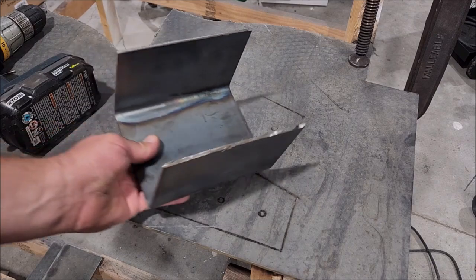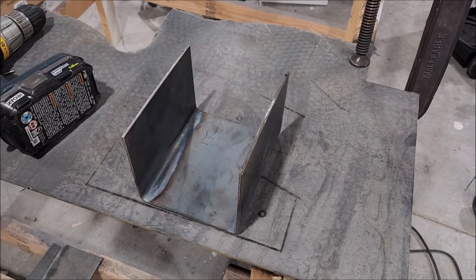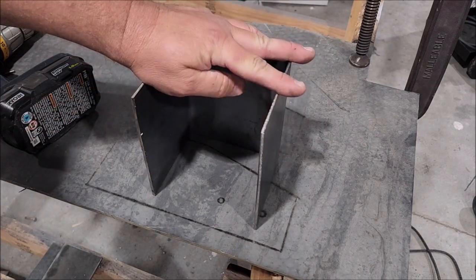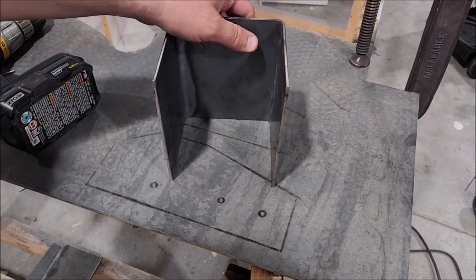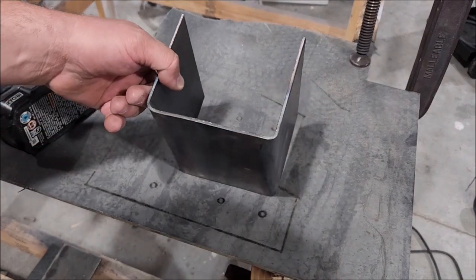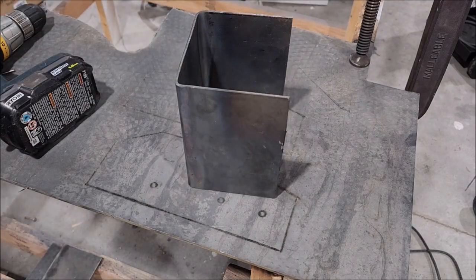It has cooled to the touch and I'm happy — I bent it. Welding it would have looked a little on the homemade side, but it would have been quicker. This turned out pretty good, it's decently flat. They're about equal, sits okay, and it's a little off on the right angle — this could be toe-in just a little bit — but I would say it's perfectly acceptable. I made a stencil out of a piece of paper with all of my dimensions on it.